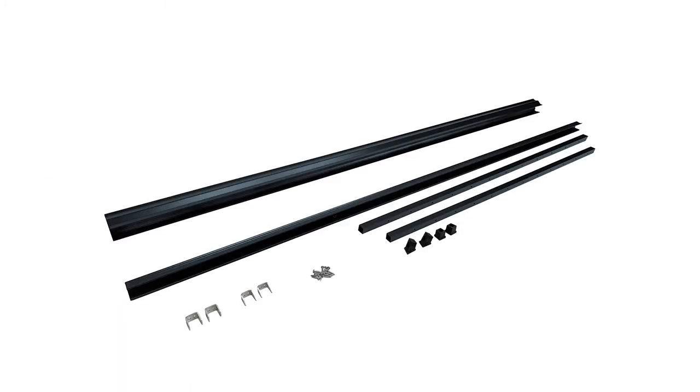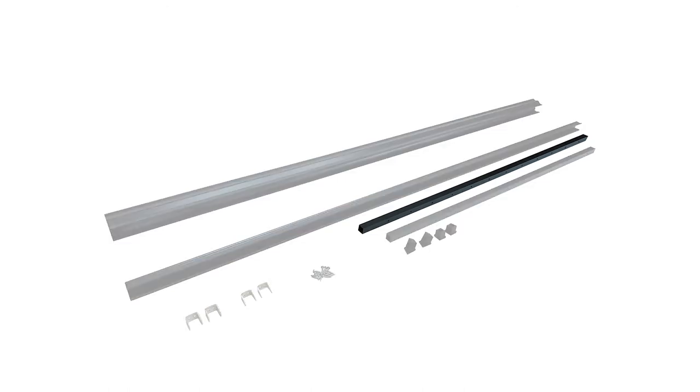Clean cut areas and apply touch-up paint on exposed ends. Ensure the U-channel is completely bottomed out in stair rail clips and temporarily attach the upper U-channel to the upper stair rail clips. Important: For stair applications, only use the stair intermediate cable support, which is the longer of the two and measures 45 and 5/16 inches.